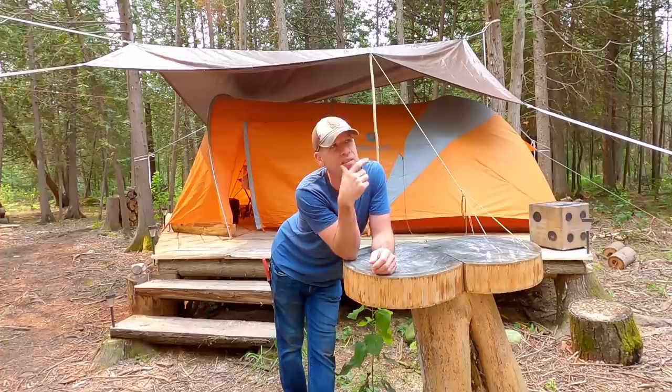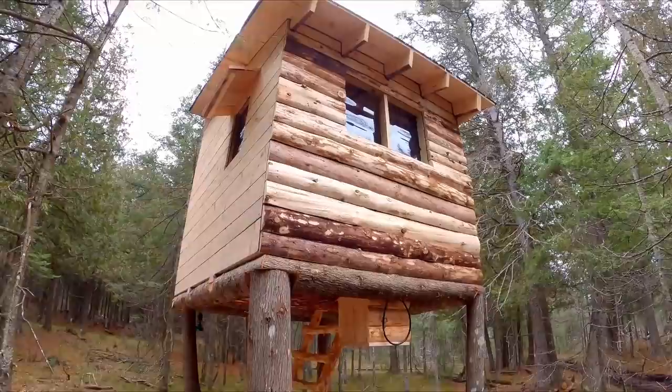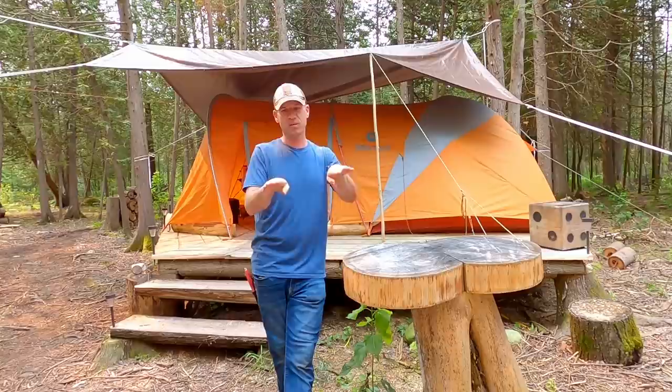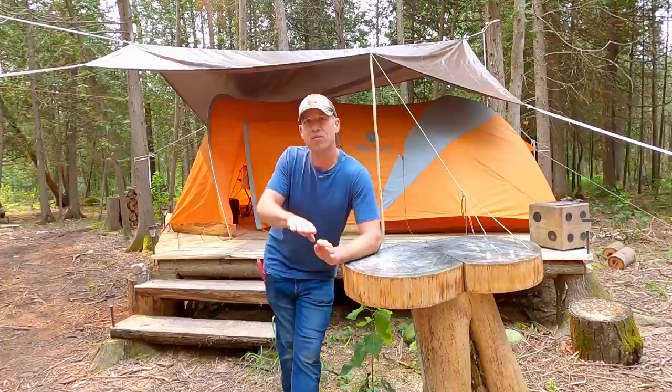The little roof I made for my generator, my little bitty generator, it's not really waterproof because I sealed the roof like I did all of the deer castle. You know, use those cutoffs that I mill, like the end of the log, the first and last cut of the mill. Snapped a line on those pieces, ripped it off with the chainsaw, ran the hand planer over it, put them all together, and then the cracks I just filled in with roofing tar, basically, which is totally not the right thing to use, but it's what I had on hand out here, and it's super cheap. So as the lumber dried out, the cracks got bigger, pulled that stuff apart. So anyway, it's leaking. I might work on that.